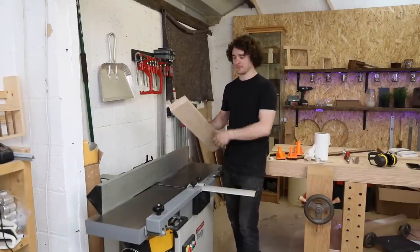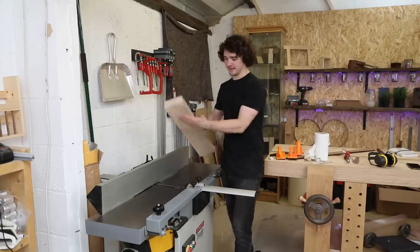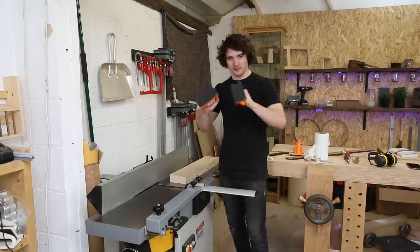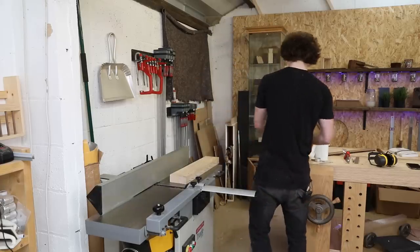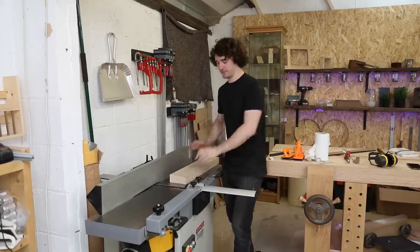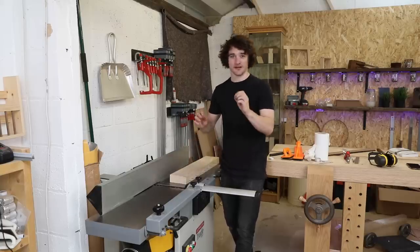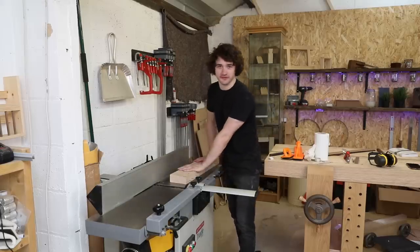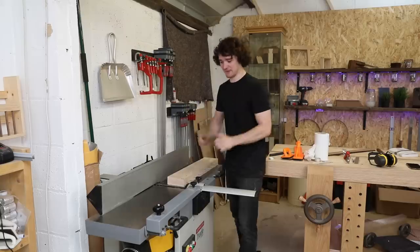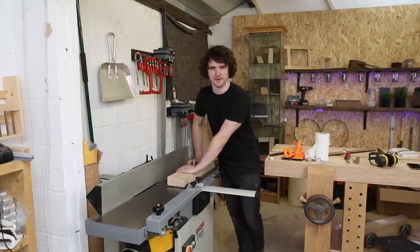So we've covered safety with hand and guard placement, grain orientation for a clean finish, and how to pass wood over the cutter block. One more thing: don't wear gloves — loose material can catch in the cutter block and take your hand with it. For grip, use anti-friction wax on the bed. And I've heard — though I definitely haven't done it myself — that a little spit on your hands makes them quite grippy. Wash your hands before your sandwich, but it apparently works.